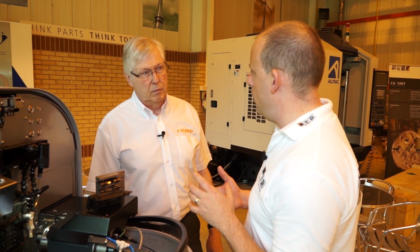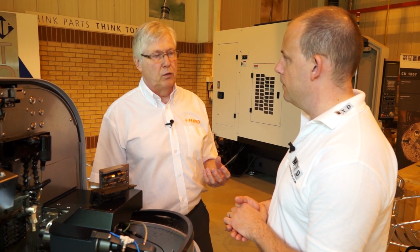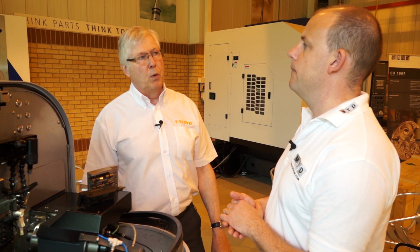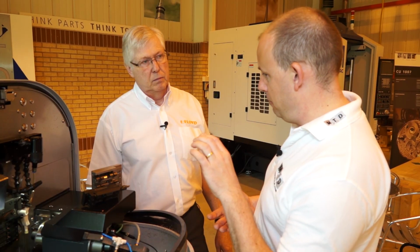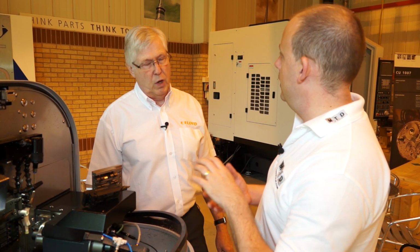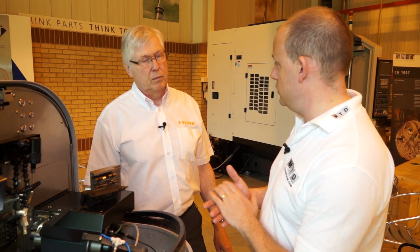So I can see that, Eric, but the tooling arrangement does look very compact. What about if you had a bigger bar diameter? Well, on other machines, bigger machines up to 20 millimetres diameter, for instance, we would use a 16 millimetre square shank, which then enables you to get the tool spacings correct for that size of machine, but still keep a compact layout. So that base plate and the arrangement I can see there is because of the nature of this machine? Yes, quite. So each machine type, depending on what brand or what size you're using, you can buy a base plate to suit each pattern?